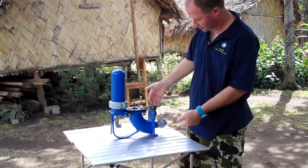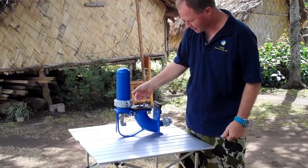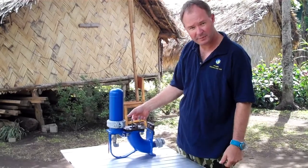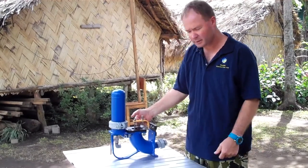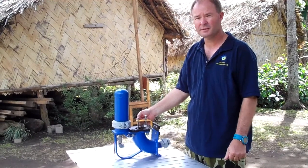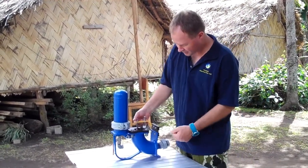As the water flows down the drive pipe and out, the speed starts to pick up. Once it gets enough momentum, it flicks up the drive pulse valve, which snaps closed, causing a high spike of water pressure within the system — around 170 psi of water pressure.